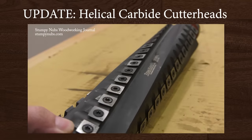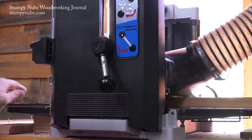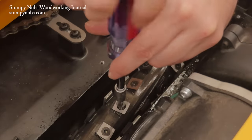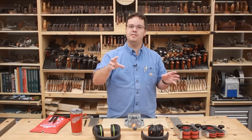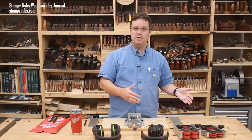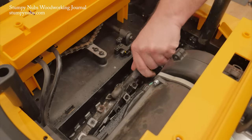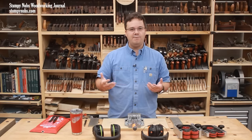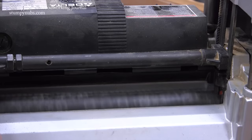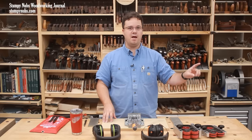This one is a follow-up to a tool we talked about way back in 2016. That's when I upgraded my first planer, which was an old Delta 12-inch, with a carbide helical cutter head. It was expensive, but I was pretty sure it was going to be worth the cost. Since that time, I've put one in my old Delta 6-inch jointer, which I still have over in the corner here. Then when I got a new planer, I upgraded that to one. A couple years later, I moved into this new shop with a new larger jointer and planer, and upgraded those to helical carbide heads too. So here I am, five years later, with perhaps more experience with these heads than anyone else on YouTube, having installed them in five machines, and having used both the Bird Shelix and the Lux Cut 2 brands. So I feel like I can add some value by giving you a quick update. These are not cheap upgrades, so are they still worth the cost? Well after five years, I still firmly feel that they are among the best tool upgrades I have ever made. If I ever get a different jointer or planer in the shop, I'm going to unhesitatingly upgrade those to helical heads as well.